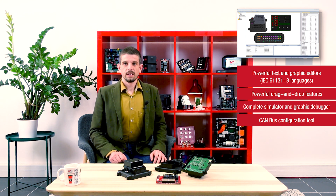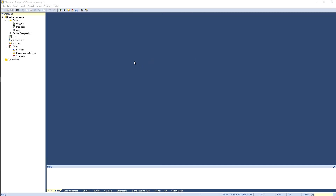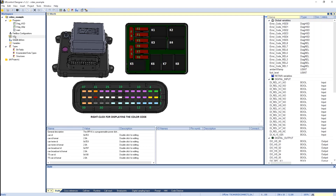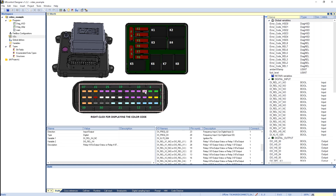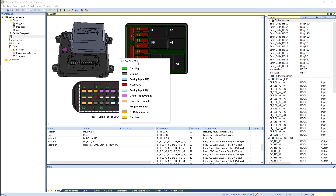Let's review together the configuration of the CANBOX 8FS6 in the tool and the easy function block programming. This is our WE-Control Designer software, which is our programming tool for our 32-bit CPU platform. Let's have a look together at the I/O and module configuration for the CANBOX 8FS6. We are on the I/O page. Here you will find a picture of the product, some information about fuses and relays, and the most important part will be the connector.